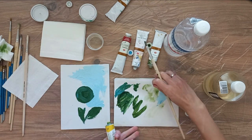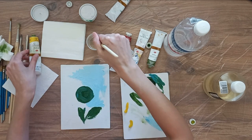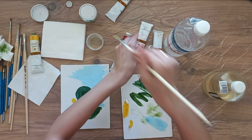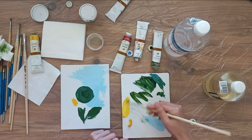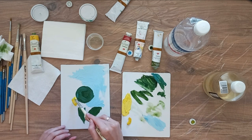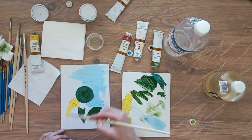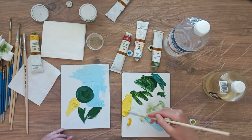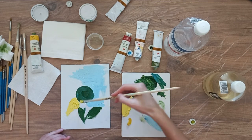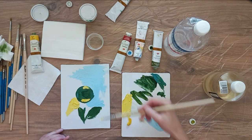If you need to change the color to the exact opposite, the brush must be washed very thoroughly — for example, in white spirit. Linseed oil doesn't completely cleanse; linseed oil can be used when you change the color to something more or less similar, like green to blue or a different shade of the same color. But if you first paint in dark brown and then need to paint in yellow, white, or light red, you need to wash the brush in white spirit or take a clean one.